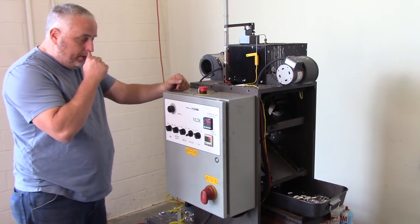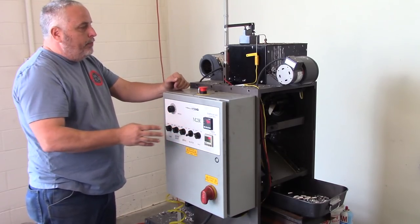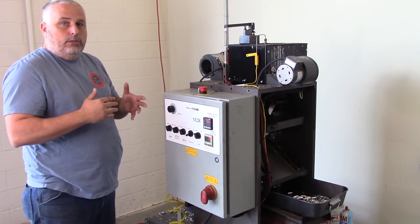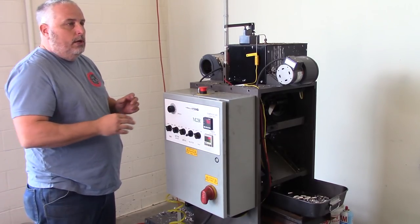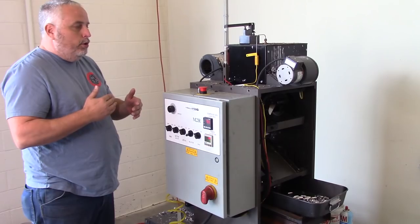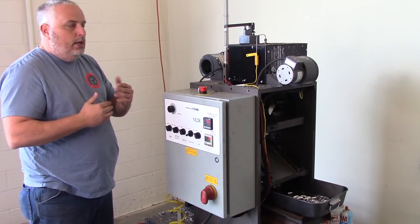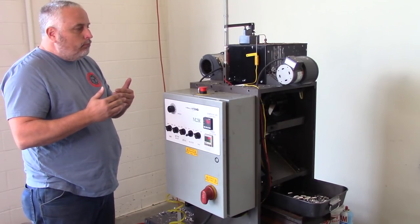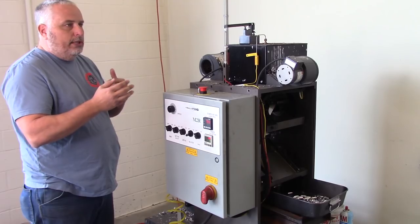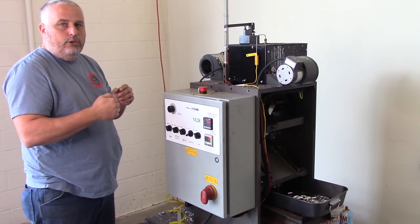And you have to adjust all these things, the temperature, the speed, the dwell, all those things have to be changed for each type of bullet that you're doing. Some need longer cool time, so you gotta run slower. Some you can move the carousel much faster. In fact, sometimes it'll even cast better because the molds stay hot, especially on small bullets where they start to cool down quickly. And then what happens is you don't get the consistency, you don't get the fill out because the molds are cooling down because there's not enough lead getting into each mold.